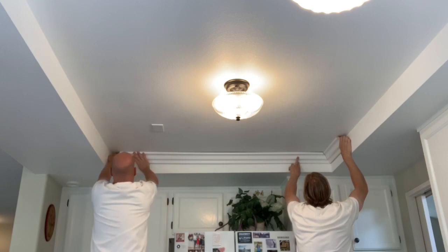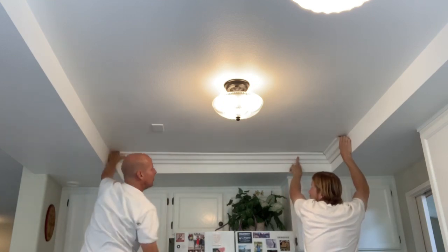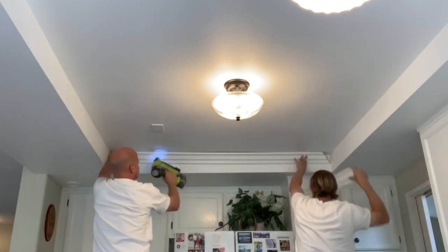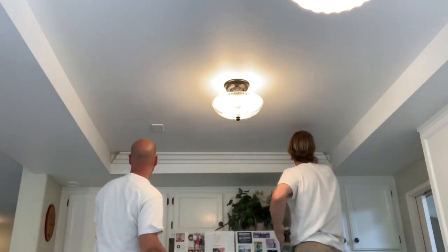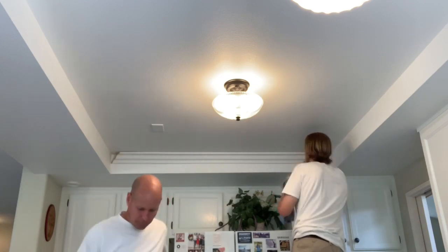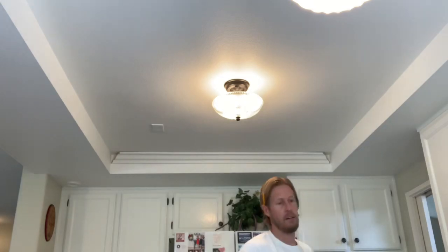We leave about 10 inches from the inside corner from the nails so we can still work with it — it's not done yet. We'll get this piece lined up as best we can, nail it off, and then do the piece behind us with the testers again. When you do the two side pieces, you don't have to use the testers anymore — you just pop those pieces in. And before you put those pieces in, you glue them, so everything is glued together.